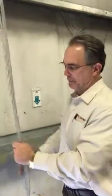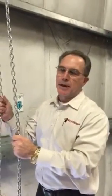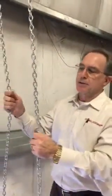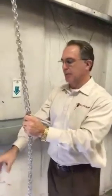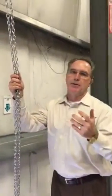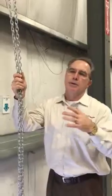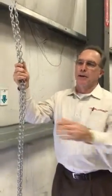So what about going into the up position? I do find that a lot of customers are slamming the door into the stops at the top, and they're causing a lot of damage with that. Same. So it's the reverse of what I was talking about earlier, going into the ground. They're doing the same thing with driving it to the ceiling. You're doing the same damage to the door. Not damage, but you're putting the door through stress, reducing the cycle life of the door.